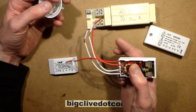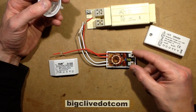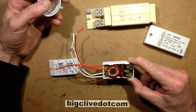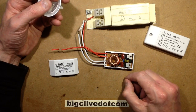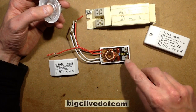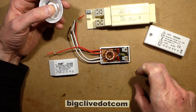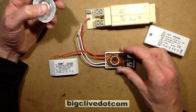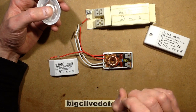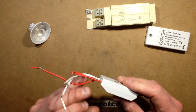Another notable feature is that because of the way this one works, it requires a minimum current for the feedback winding to provide meaningful current to the bases of these transistors. Because the bases are isolated through the transformer, it doesn't really matter which rail they're connected to. However, these require a minimum load — if they're not above 20 watts in this case, they'll just flicker or pulse; they just won't work right. And that also leads to problems with LED lamps, because they don't like that at all.